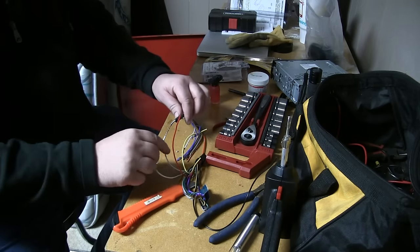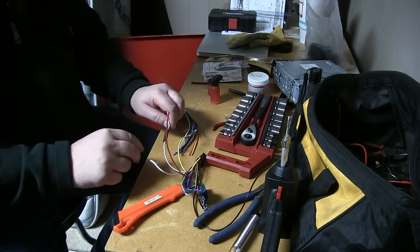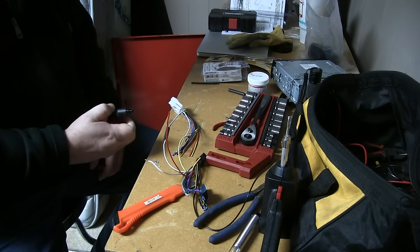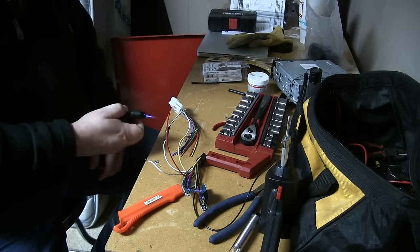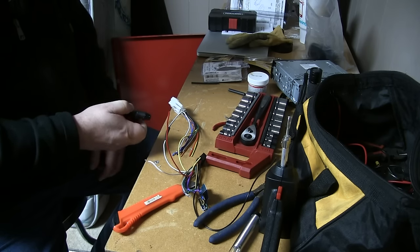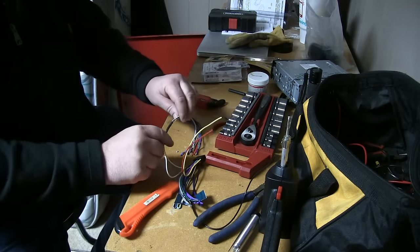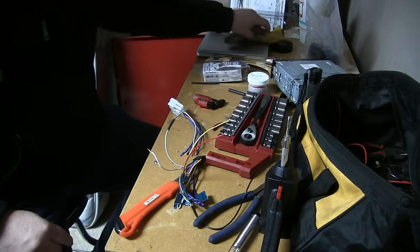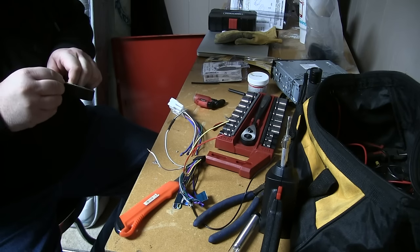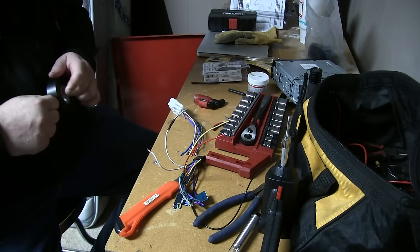Now you want to allow that to cool, and I'm just going to slide this heat shrink on. I'll admit I'm a little bit unprepared because this type of torch lighter does not work — it's too hot. Really, just a regular cigarette lighter works the best because it doesn't get quite as hot. So I'm just having to give this a little bit of heat at a time, and then that just shrinks up and makes a good, tight fit. A lot of people leave it like that, but just to give it a little bit more insulation in case some of that solder poked through, I like to go ahead and get some electrical tape and just wrap it around there a little bit.